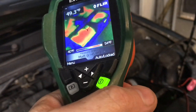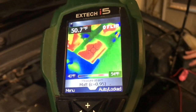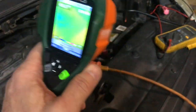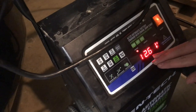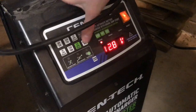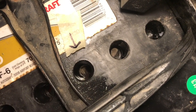After about 13 minutes the battery has been heating evenly — there's no single spot getting really hot. We're going to shut it off, let the battery cool for about 15 minutes, and then do another cycle. Right now the battery is at about 13.1 volts. For the next cycle we'll try 12 volts at 40 amps. The charger shut off after about 10 seconds since it detected the battery was full, so we'll put it into start mode. We're looking for the fourth battery cell specifically to start bubbling, but so far it hasn't — I can see bubbles on either side but not on that one.